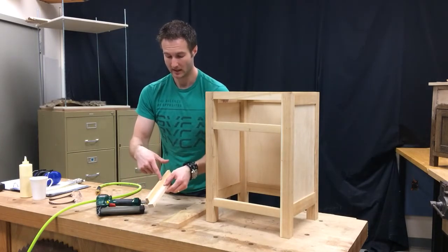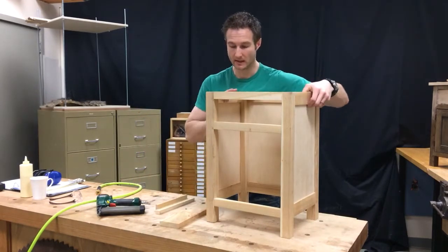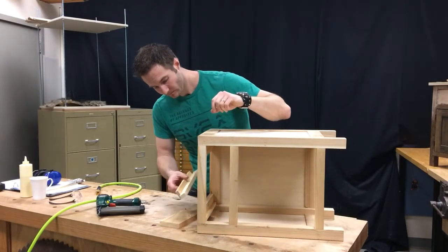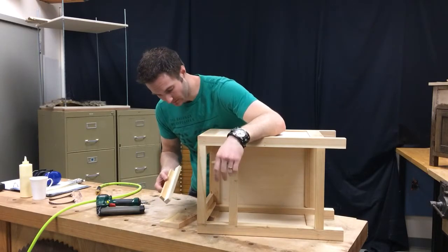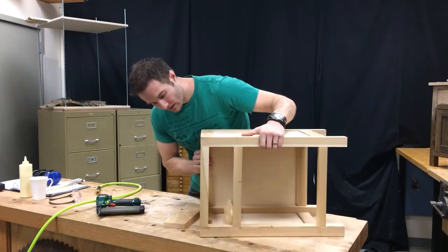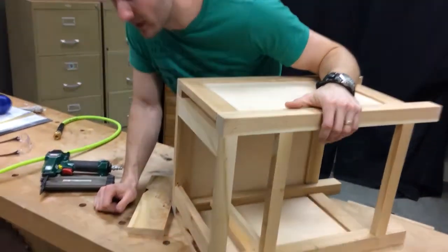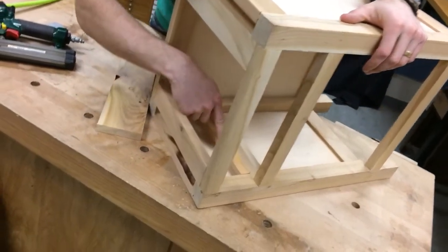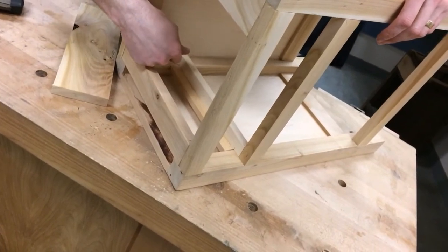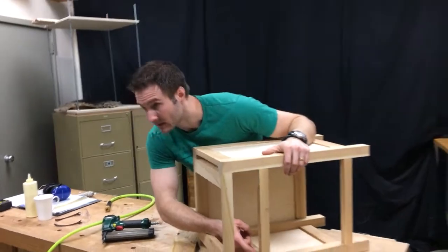The length of this side piece should fit exactly between your legs — inside here. At this point we can move it sideways, because we're going to have it in this position when we go to install it. It's going to fit in here just like this. You can see how that fits in there — Trenton's already made this thing to fit. The side part that keeps the drawer from racking fits nice and tight inside the legs. The drawer bottom that it actually rides on fits between the back panel and the backside of the front rail.